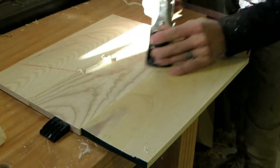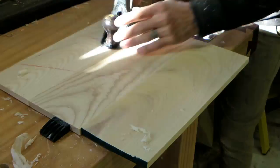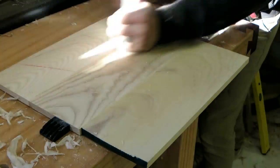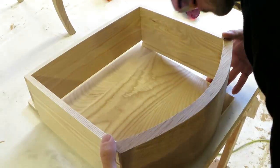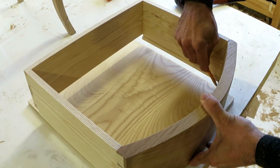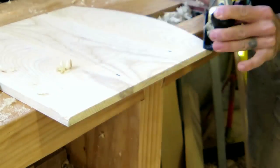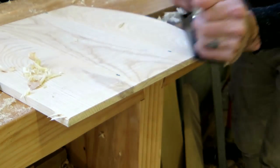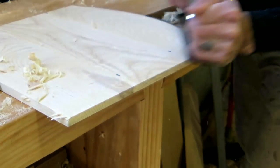And I could smooth out the drawer bottoms. And work out where to cut the curve on the front. So after doing that, I could turn the bottoms over and start planing the large arris, so the bottom slides into the grooves.